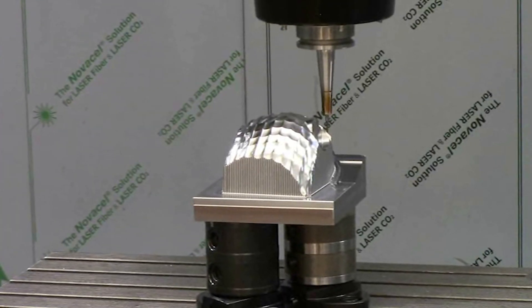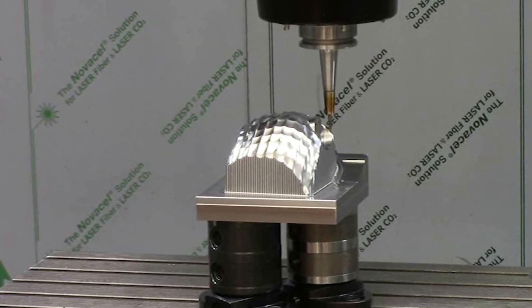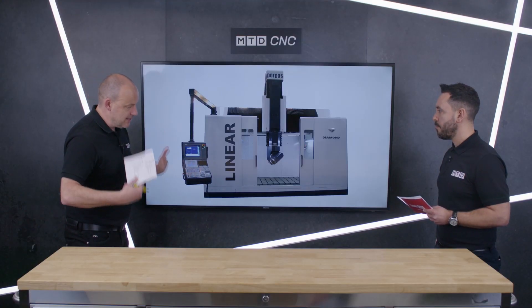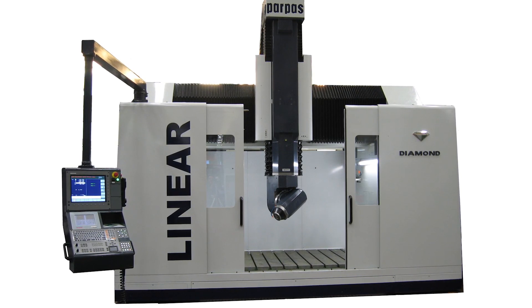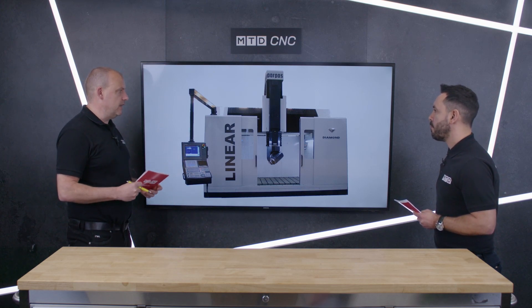Starting from the foundations for one more minute — Paul, it's a steel construction. Why is this and how important is it? It's quite important because it will be heavier, solid, and form a rigid construction. What you haven't got here is two metres of casting to dampen out vibration, so opting for a steel structure gives a similar result with less mass. Also, the movement on X, Y, and Z is coming from elsewhere — it's not coming from the table.